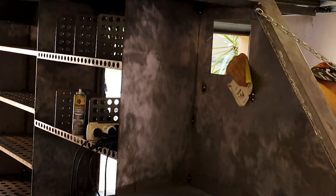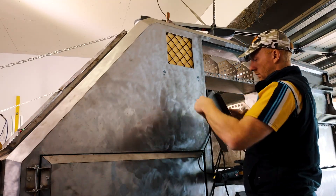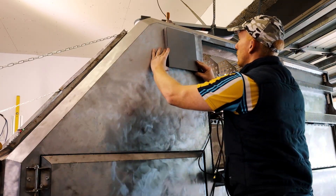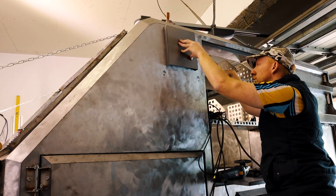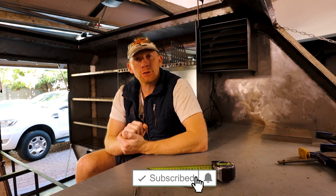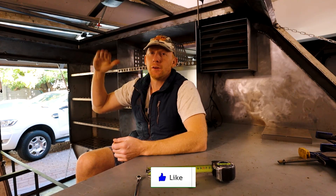Here we have our first problem. Initially I thought that this intake cover with its bottom open would allow enough air to be sucked in, but that little slot does not deliver nearly enough air for the fan — it cripples it completely. I'm going to design a cover with louvers that will still expel water but allow a lot more air to the intake. Looking back at this I don't know what I was thinking trying to supply this monster fan with such a small intake. As always, thank you so much for watching till the end. Please like and share the video with your friends and family and please remember to subscribe to the channel — it helps me out a lot. On the next video I'm going to be working on the pop-up roof getting all the mechanisms in place to lift and lower it with gas shocks. Stay tuned for that and I'll see you guys on the next one. Thank you and cheers.